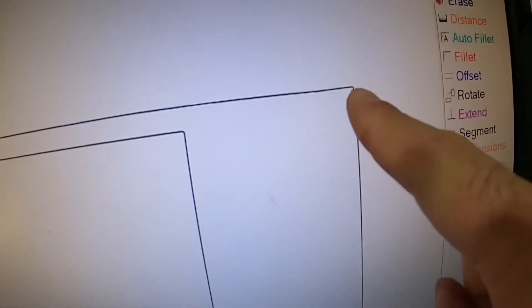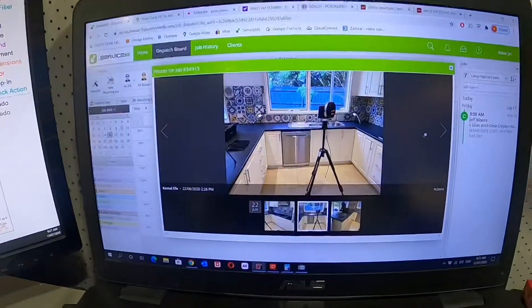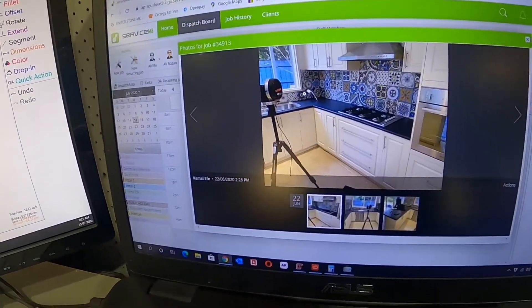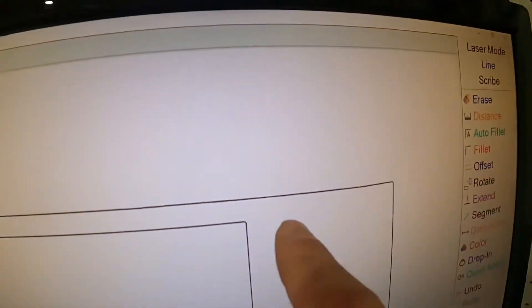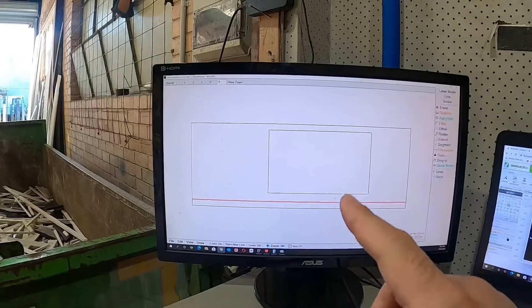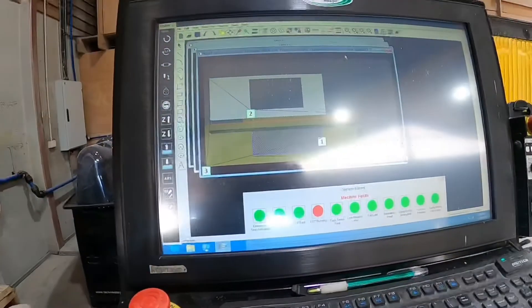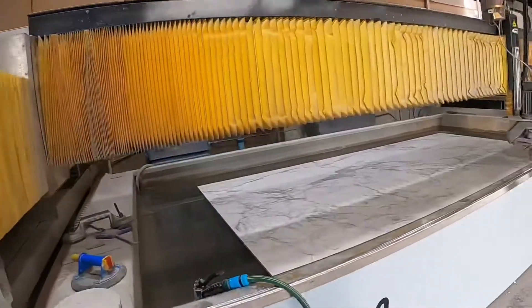You can see the off-squares on the wall — that's from our laser templating work. And this is the kitchen here, with a nice waterfall going in. That's our laser LT55 in 3D. These beautiful tiles are being kept by the client, and that's why we've scribed the walls — it's cutting to every single tile. That's the software of the laser, and it's modified slightly for slab optimisation on this system. Then we basically hit a button and watch it cut.